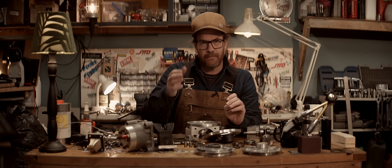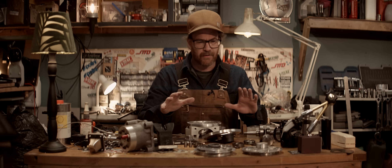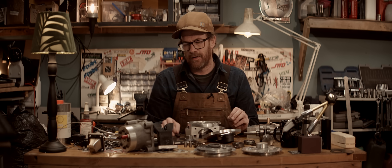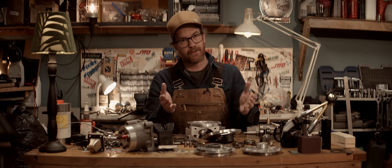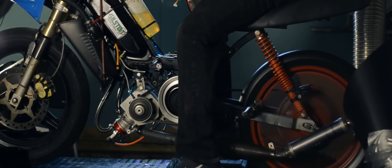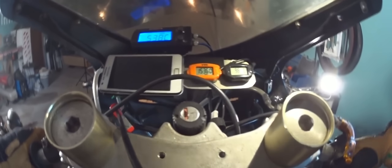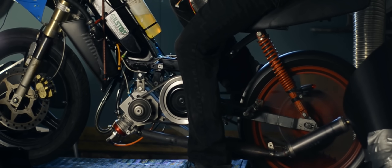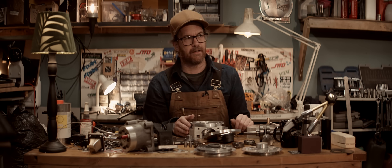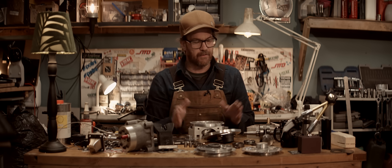I'm pretty sure it's too tight. A little recap to get people on board - you really have to go back many years and watch my videos. I'm creating the most powerful two-stroke ever, that's my goal. This started many years ago when I was playing with that old engine I'm always talking about. I can't show you it because it's sitting in my land speed bike in Arkansas with all the spare parts for our Bonneville attempt. That old engine has a ported EA with a 50cc cylinder I ported - it produces about 18 horsepower to the wheel on the dyno through a variator, so probably about 23 horsepower at the crank.